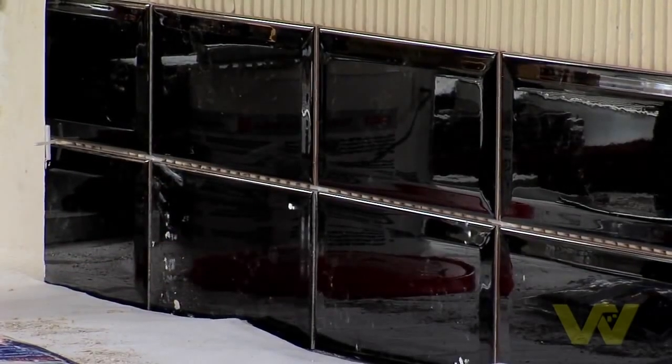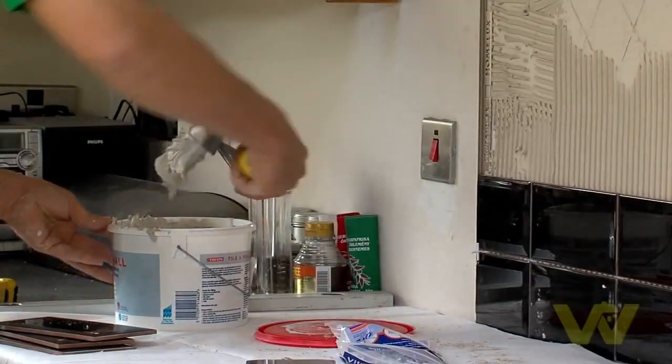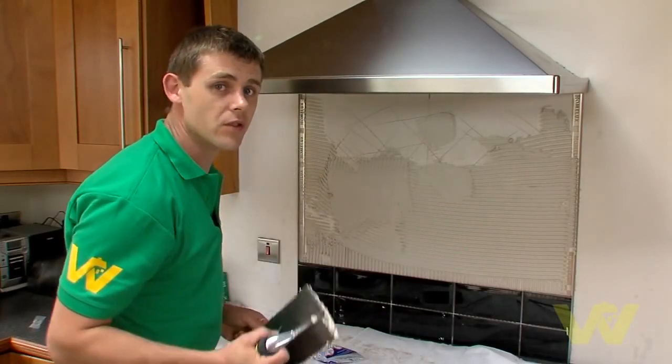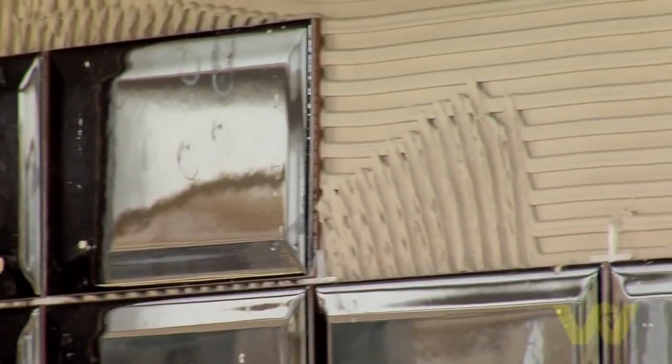Apply more adhesive and this time we'll take it straight to the top because the hard work is done. It should be faster and it's easier to put it on now than when there's more tiles on, as you have space to use your trowel. Build the tiles upward in a grid pattern, going left to right as you work.